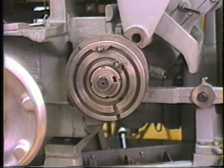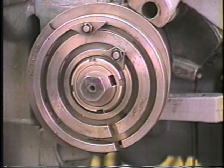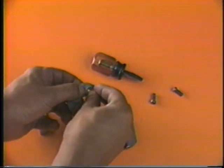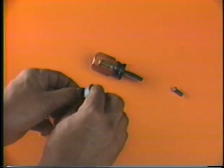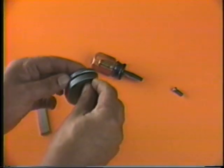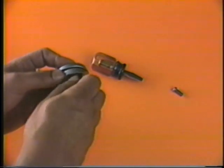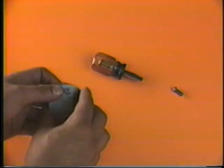Advance the machine until the revolving head is locked into position, approximately 95 hundredths of the cam. A washer approximately the same thickness as the Cut-Off blade must be placed between the front and back sections of the holder and aligned such that the top screw secures the washer in place. The top screw should be secured first to prevent the holder from warping.